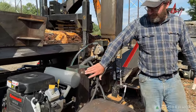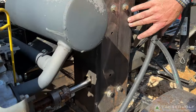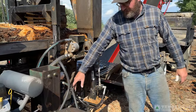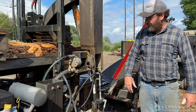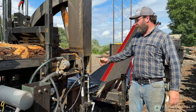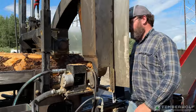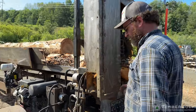There's our transfer case, it's an A-belt in there. We've cleaned some of that up on the production model, looks better, but that works real slick. Allows us to run two pumps, and then on another model we have a third pump. Saw motor there, Danfoss saw motor into our saw box, and then sawdust chute here. Look how easy it is to adjust your chain. You can step right up in here, sharpen it, adjust your tension, real easy access.